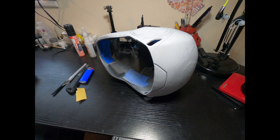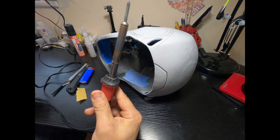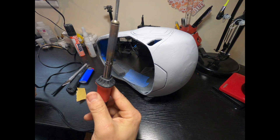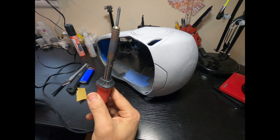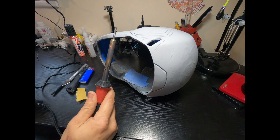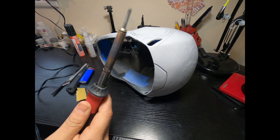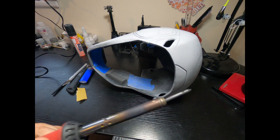What I've been using is a $3 soldering iron and actually melting the parts together. This doesn't fully melt the plastic like a lighter would — it actually melts it down to basically what it was when it came out of the nozzle and extruder, and you can use the soldering iron to fold and melt the plastic back together. I'm going to show you how I do that.